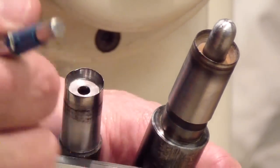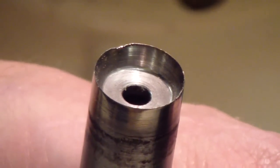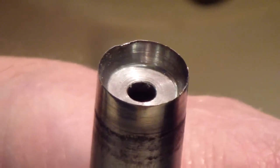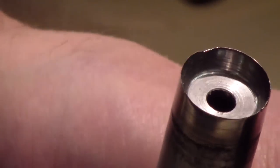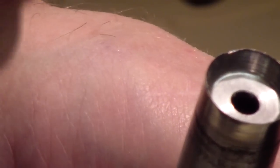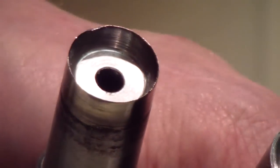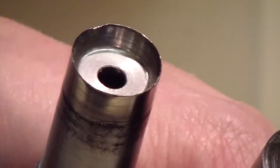It's straight here, and it's tapered on the inside. For those of you who are doing the inside-out business ornaments, this thing is really nice because you don't have to glue them together, because it pinches them together. I turn it, back the tailstock off, turn the inside out, put them back together, bring it back out, burn it in just like it did before, finish turning, and I'm good to go. But you must taper to the inside because you want your new pieces pushed together. You do not want to split your wood apart.